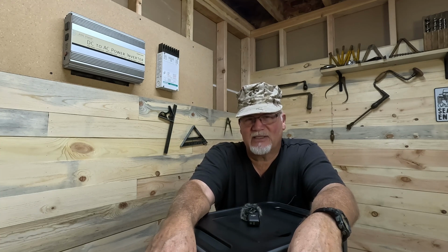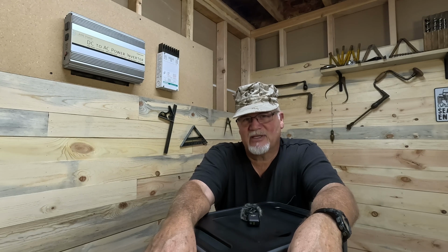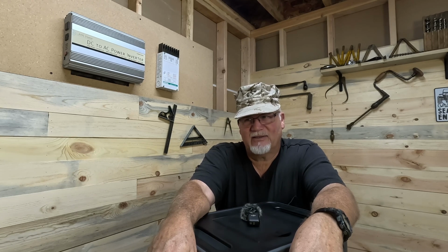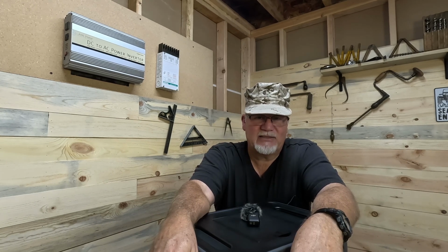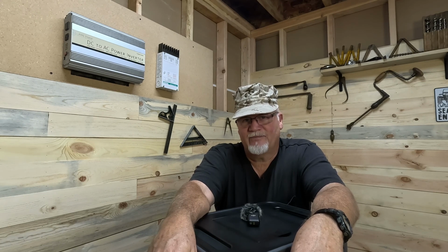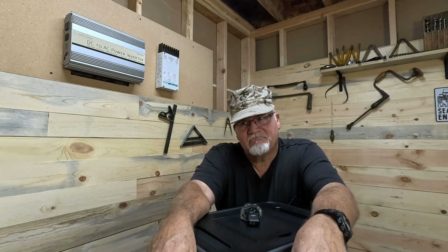I only drained it down to about 78%, maybe 76, something like that, in the 4 hours that I was out there working. So yeah, in another 4 hours, if I'd put a full 8-hour day in, I might have drained it to 50%. But the next day, if I stayed 2 days out there, I'd still have 50% left to drain if I needed to. So if I had a set of solar panels, I'm in like Flynn. If I had a generator, I'd run the generator for an hour at 50% and charge it right back up again. 1 hour versus running my generator for 8 or 10 hours. I think it's worth it.